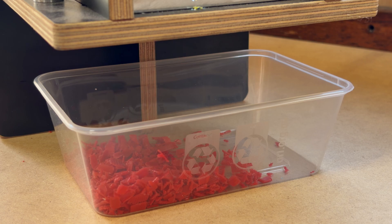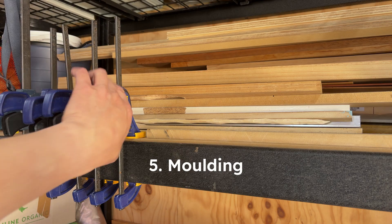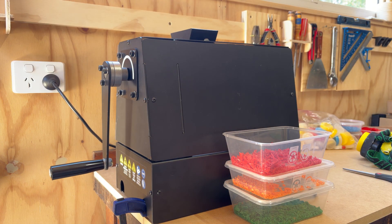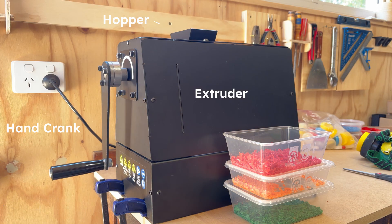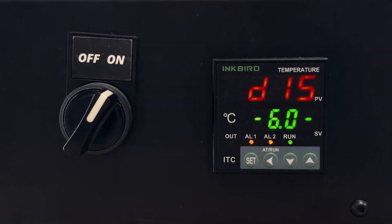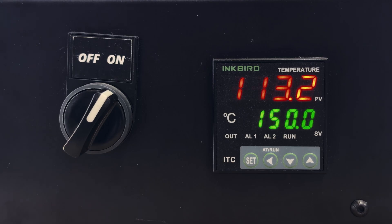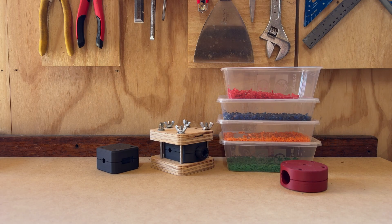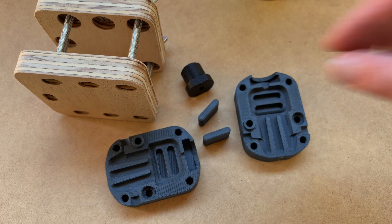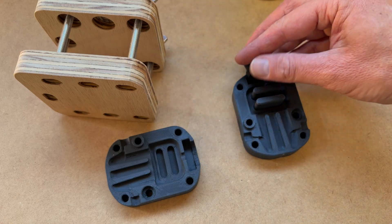You can shred by hand with scissors or a knife, but it's a pretty tedious job that way. To mould the parts, you're going to need a DIY extruder or injection machine — there are many types available, and also plans to build one yourself online. I technically have an extruder; it has a hopper to add material and a hand crank to push the material into the mould as it's heated. Firstly, you preheat the machine to a suitable temperature for the chosen plastic — for LDPE on my machine I set the temperature to about 150°C or roughly 300°F. Next, I recommend spraying some mould release on the parts of the mould that will be exposed to the molten plastic to help with release. Then you fasten the mould together; I use an external plywood housing these days to keep it all rigid.